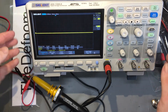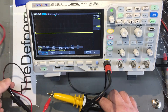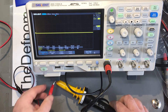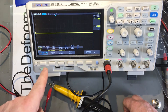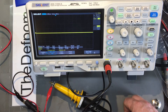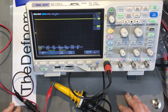I've got the probe hooked up to the SDS-1104XE, just on channel one. I've got my bench power supply hooked up in series mode onto the probe — zero volt and positive connection. They're set to 62 volts DC; maximum the supply can do in series mode. I've set the input to 1,000 times probe, DC coupling, 20 volts per division. Turning the power supply on — there we go, three divisions change. Reading about 60.6 volts.